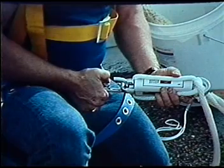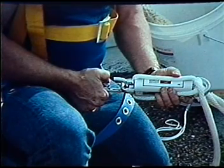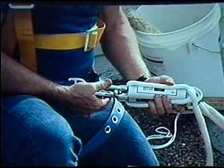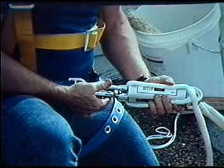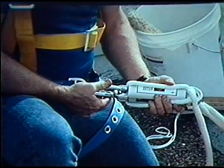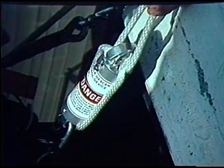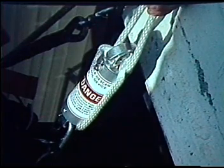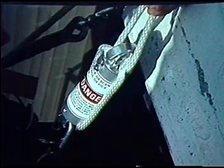Attach the lower eye of the Sky Genie to the D-rings on our seatboard using our locking snap ring. Now, loop both lines over the top eye of the Sky Genie and tighten them. This makes sure the Sky Genie is in the locked-in position. This is like setting a safety brake on your line before you step off a structure and prevents you from going anywhere until you are completely ready.